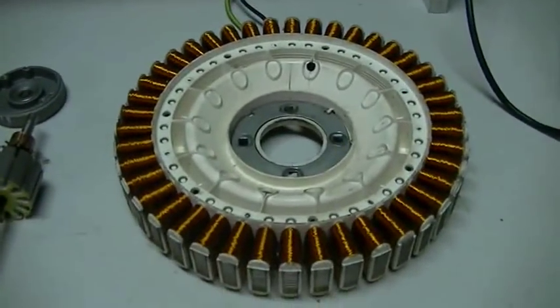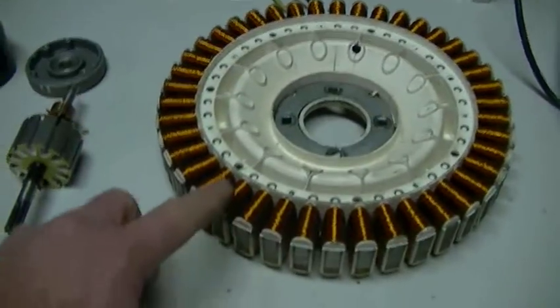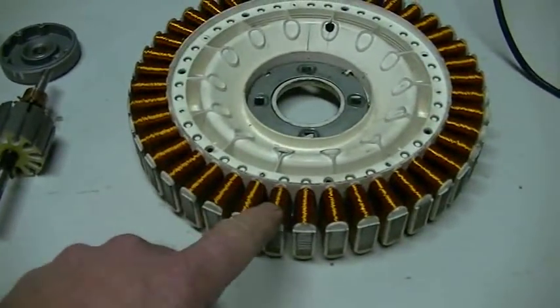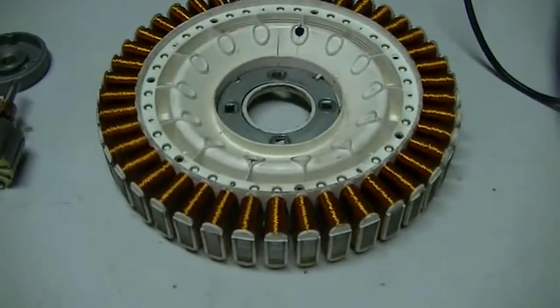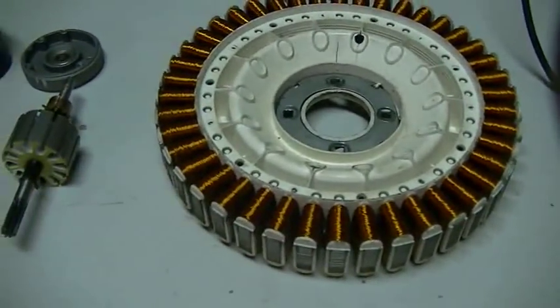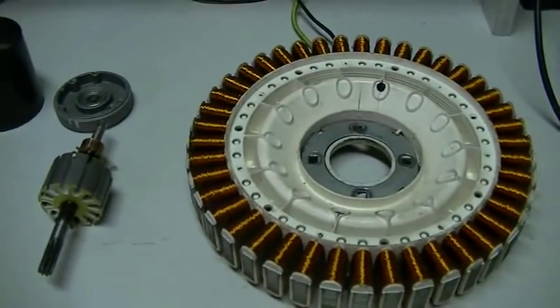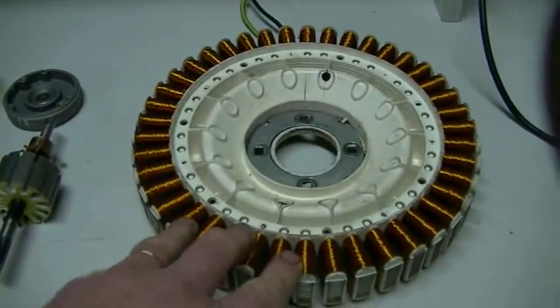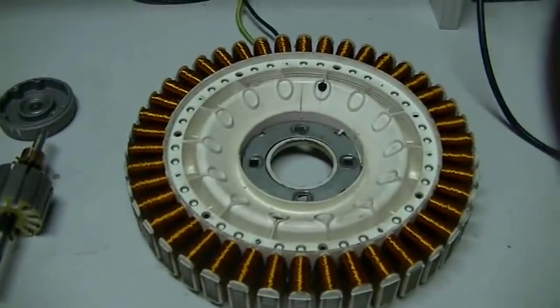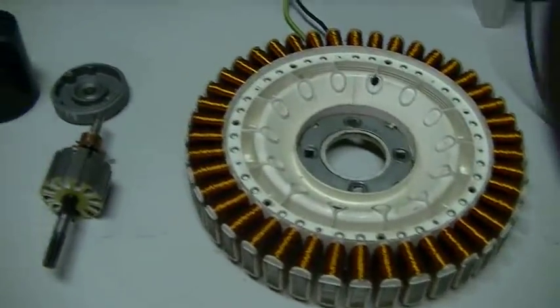First I've got to get the wire off this stator, which is quite easy — it's a three-phase motor so the wire peels off every third slot, then you go around and do the next lot. It's a great source for wire, though I'm not sure the guys in the US are finding it as easy to find these motors — perhaps they're only Australian. Okay, we'll see you next video, thanks for watching.